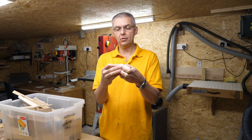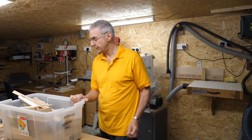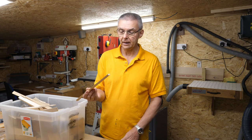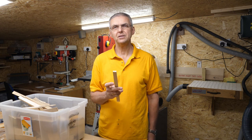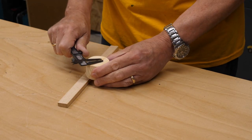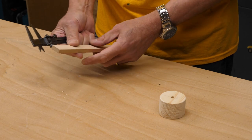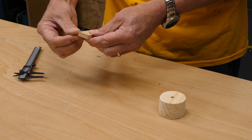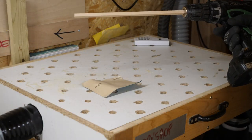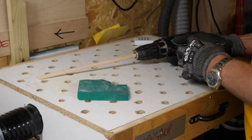All these circular pieces are going to be held together with a dowel running through the middle of them, except I've got no dowel. I've had a rummage in my box of bits and come up with this piece of wood — I think it's probably a piece of ash — and I'm going to have to try and make a piece of dowel from this. The diameter of the holes is 6mm and this is 8mm thick, so I'm going to cut this piece of wood to 8mm square section and then shave the edges off. If you try this, make sure you've got some gloves on.